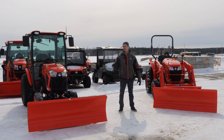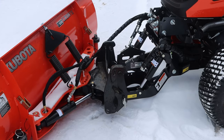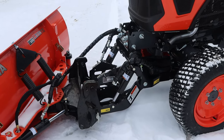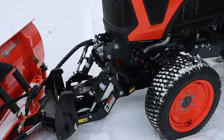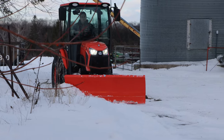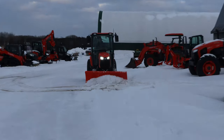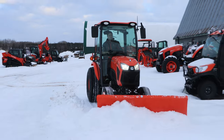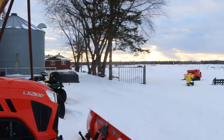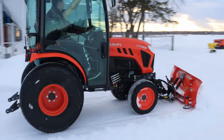Now let's talk about this frame-mounted blade here on the front of the LX. Kubota makes a selection of frame-mounted blades, whether it be for the BX, B01, LX, or the Grand Ls — there is a selection available. Some of the reasons you may want to select a frame-mounted one: you already have the hardware, you've got that front snowblower so it's a quick and easy switch between the two, or you're pushing a lot of snow, or possibly you don't have a loader. If you're doing commercial work, more than likely you're going to be selecting a frame-mounted one. There's a lot less wear and tear — it's going to absorb those hits a lot better when you do accidentally catch a curb. There's a lot less to bend on this. It should absorb impacts better, whereas a loader-mounted blade hitting a curb can potentially damage the loader. Wear and tear on the pins and stuff can add up on the front of a loader, whereas this is a little bit more simple and durable.